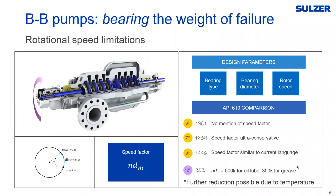Now we'll do a dive into the modern analysis of old bearing assemblies, and we'll let Ryan take these slides. I want to start off by highlighting three points in API 610 that have changed over the editions related to bearings and bearing requirements. The first is the rotational speed limitation. If you go back to the early 1980s, there was no mention of this speed factor at all. The speed factor is rotational speed times the mean diameter of the bearing, and these are for roller bearings specifically.